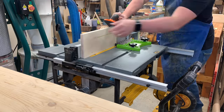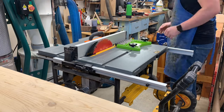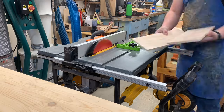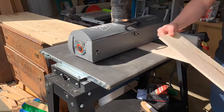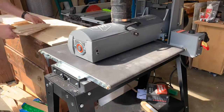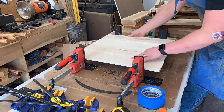Here I'm re-sawing some maple into thinner panels — this is really important. This creates the end grain mortar in between the rows. These are about three-eighths of an inch thick, and after planing and glue-ups I'm hoping to get about a quarter inch for the mortar pieces. You could flatten that on a planer; you don't need the drum sander.